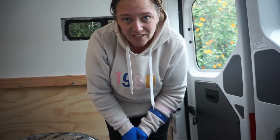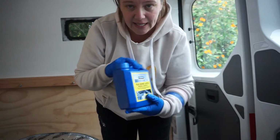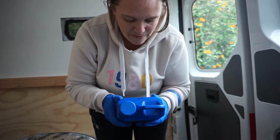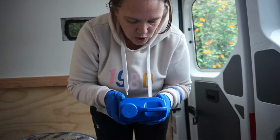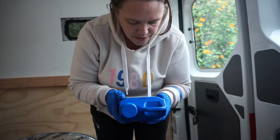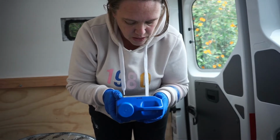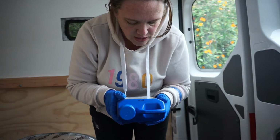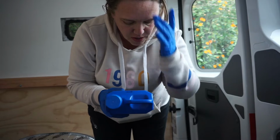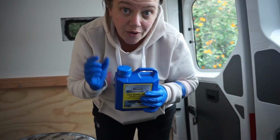I don't know how long it's going to take. I don't think it's a fast job. It's a small shower. I have a litre. I hope that's enough, and if not, it's going to have to be enough. So it says use undiluted with a roller or a brush and apply to everything that needs to be tiled, and some very porous surfaces need 2 coats. Just going to check with Daryl whether he thinks I should put it on the parts that aren't going to be tiled, parts that are going to have acrylic. So I don't know, I'll see.